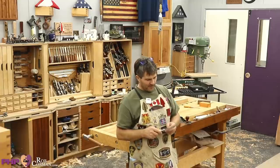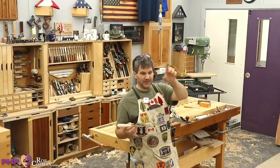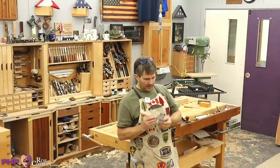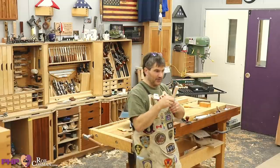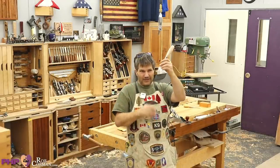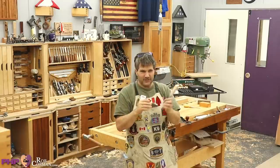Yeah, true. Jake just said through wedge tenons. You do see the outside, and that is going to be cut with this. So as you can see, Jake has polished the back of this one. Get yourself a Jake. And you do want it to be sharp, because when you're going in there, particularly on a through wedge tenon where you're sloping the wall, you want that to hold. You're cutting down through, slicing down through end grain. And if it's the least bit dull, it'll slide off and makes it very difficult.